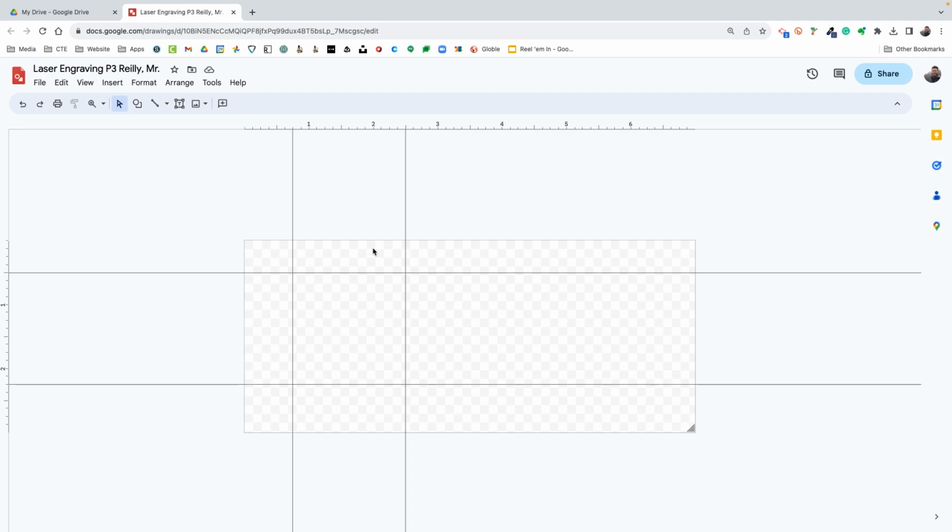So now let's talk about laser engraving, what kind of designs you can do. Pretty much any type, I'm going to say this slowly, pretty much any black and white image will work. Okay, can't be multiple colors, and ideally it's black on white, not white on black. I'll show you an example in a second, but pretty much any kind of black and white thing I can engrave. Okay, any type of grayscale I can kind of do as well. Results vary.